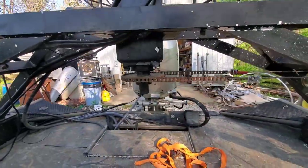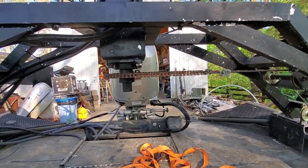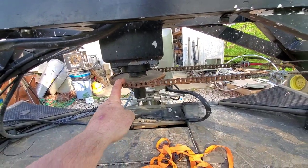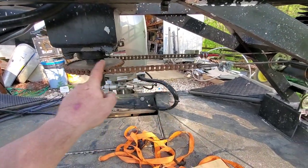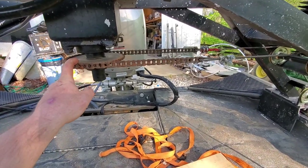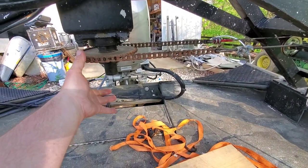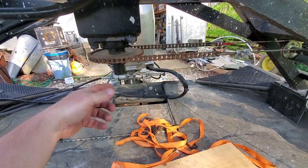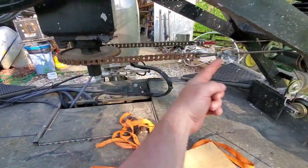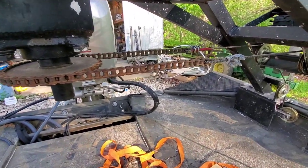Down the main shaft, this is what's known as a drum-style steering. The sprocket and chain we have here is the exact same sprocket and chain that's on the front of the boat. The reason we use a chain and sprocket is it's just easier and cleaner. You can also do a solid cylinder down here the same size as the one in the front and just wrap the cable around it about three times and go back out the other way. But this is kind of the way a lot of guys tend to do it — it's cheap and it's easy.